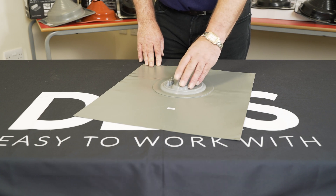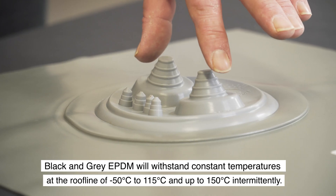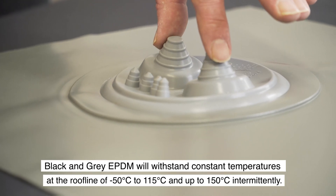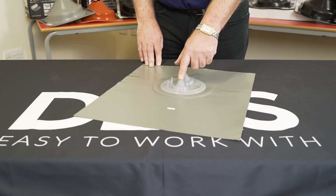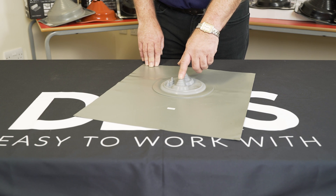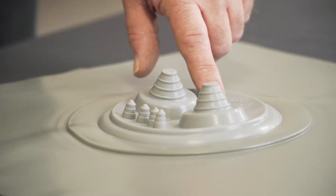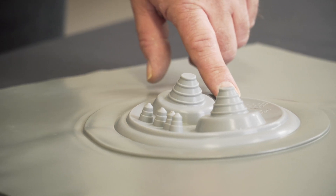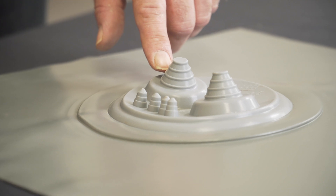It's available in grey, and one thing we must stress is when you pass a pipe through this flashing, you must cut to the pipe size, not to the insulation size. It's not designed to seal on insulation. There's a cutting guide printed on the flashing to let you know which groove to cut for each different sized pipe.